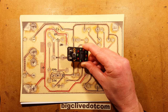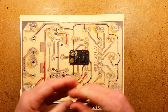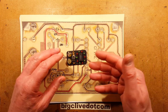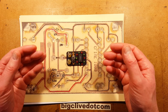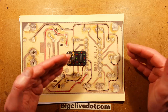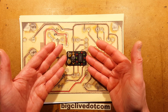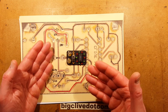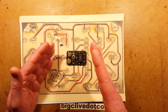But it was novel. It was one of many items I made around that time that I took in and just played about with. At the time, I was trying to work out the circuitry for deriving the ultimate bass detection for disco lights. And it's a very complex subject. You can't just filter out the bass and then look for peaks, because as soon as voices come in, it skews that, because the voices are sort of broadband noise. The best you could do is count the bass and time it when you had it, or treble, because sometimes the treble is more pronounced than the bass.